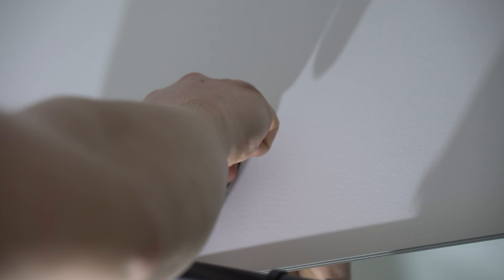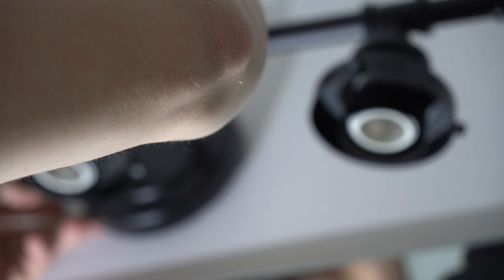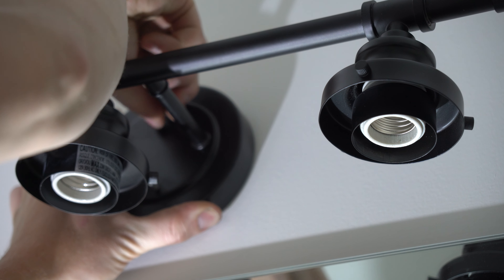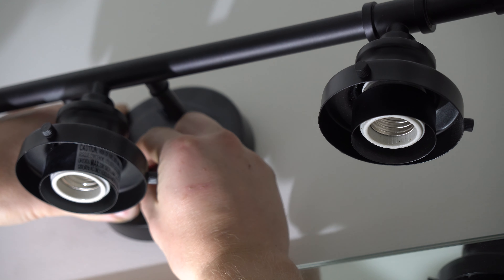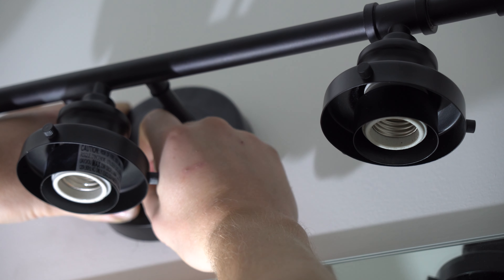After you do a pull test, do that with the rest of the wires. Ground's going to go to ground, and black's going to go to black in the junction box. Since this is a shallow one, they put the big screw right here for the ground. I've capped out as far as I can go against there. This is one of those fun little installs — let's double-check and make sure it's going to work. Tuck in the ground wire and tuck in the nubbins. Make sure the ground wire is still tucked in.